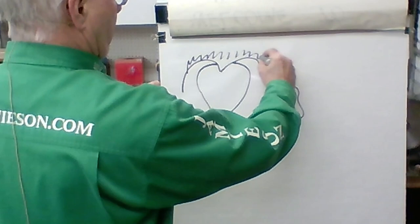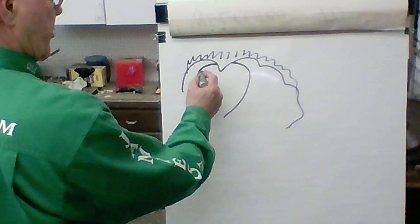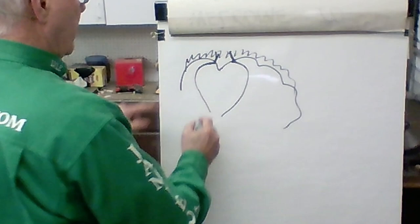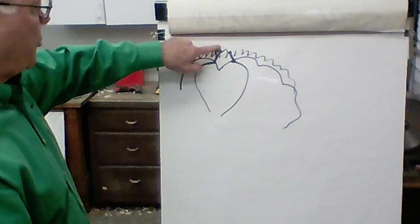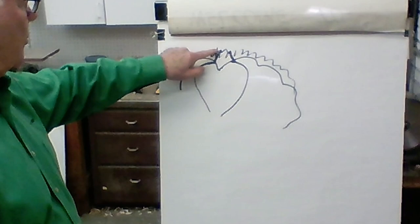There are some other kinds of burls that are just kind of gnarly and don't have a lot of separation in lobes or voids in them. So in this case I would do a shape that has a neck on it to take advantage of the gnarly surface. I'm going to do this approach here with a neck on my vessel because I don't have a significant void in the piece I'm working with.